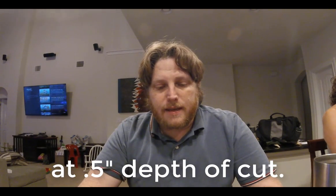Two, those high speed steel bits were amazing. The half inch bit did a beautiful job. Once I had everything fixtured down properly, the half inch bit did a beautiful job surfacing the side. 5,000 RPM. I think I was taking five thou at a time. It was beautiful. Then just on a lark, we tested the quarter inch, high-speed steel bit, at 10,000 RPM, 20 inches a minute, probably could have gone faster on the inches per minute, but it was a beautiful, beautiful result.